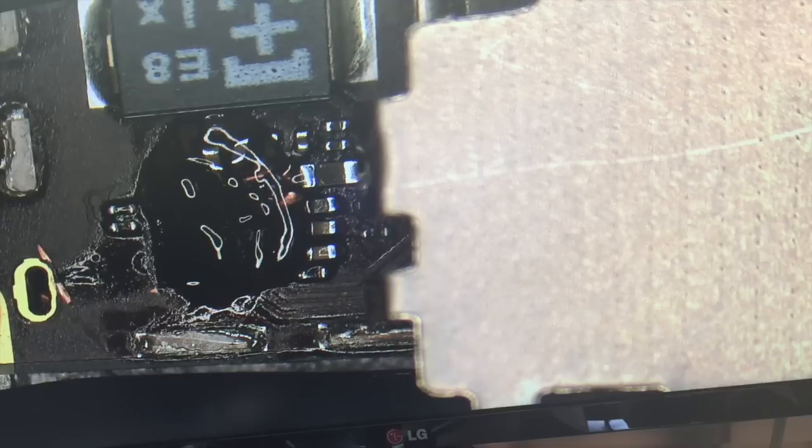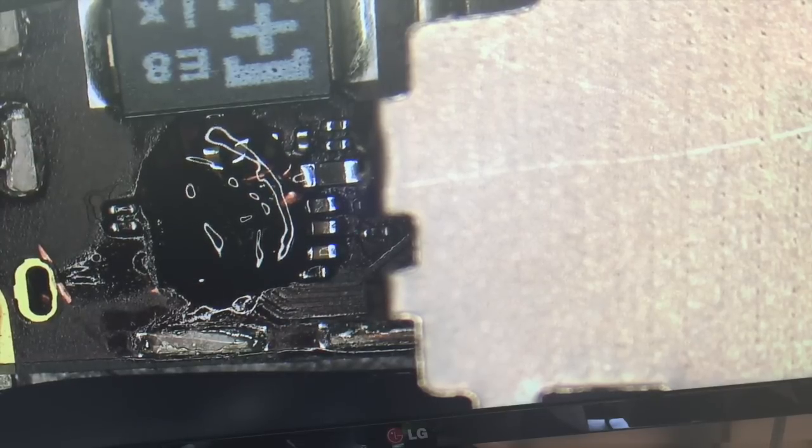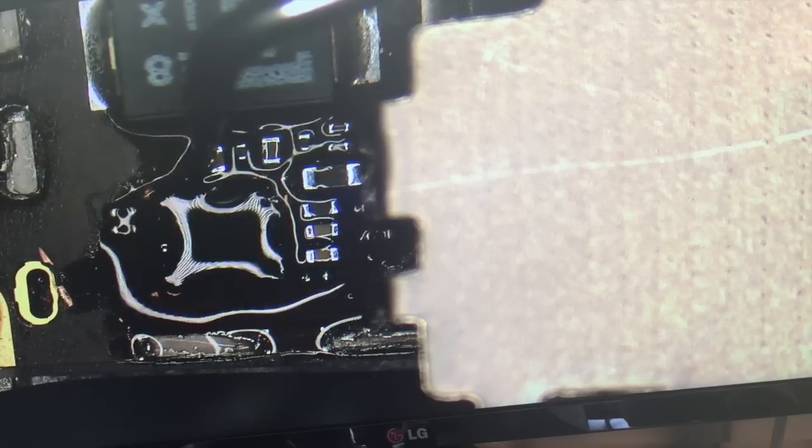What you should do instead is adjust your hot air, change your airflow, change your temperature, change your nozzle until you can get it to come off with a relatively short blast of heat. All right, so now I'm coming in here with my heat source. I'm at a bit of an angle so that I can use my microscope, and that's okay.